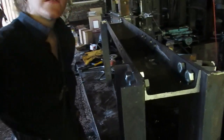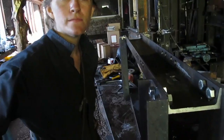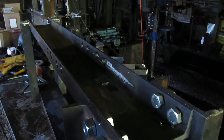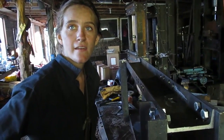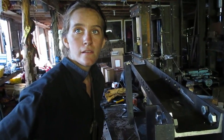One and a half inches? Yeah, just to give it enough room so it's got about half an inch of movement — I did three-quarter inch play in either direction. That makes it a half inch play because the width is half an inch already. So one and a half inch total, meaning if the width of the bolt is half an inch it can move half an inch in either direction.